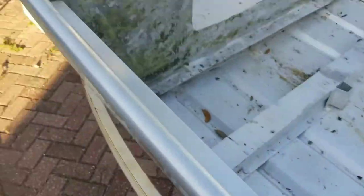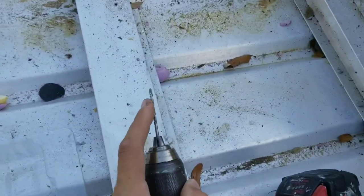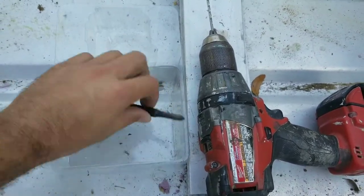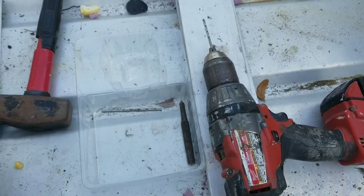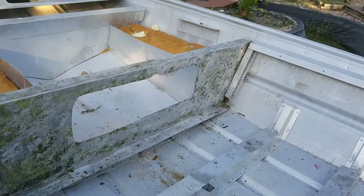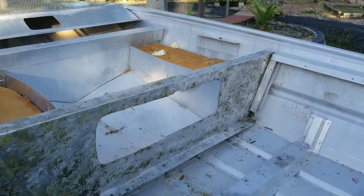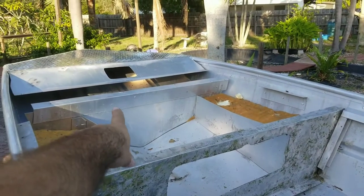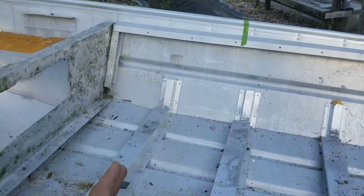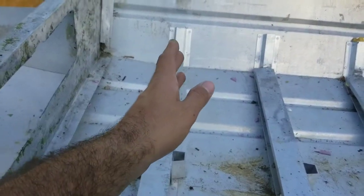In order to drill out all these rivets, I'm going to pop this front panel off — probably this panel too. To pull those rivets I've got a 1/16th drill bit, a 3/16th drill bit, a nice little punch, a little mallet, a small hammer, and a nice pair of nippers. That's all you'll need to take this whole boat apart. I'm going to take out that front part. I'm thinking about maybe leaving this front bulkhead in and that other bulkhead in, then extending the deck to just about this first rib.